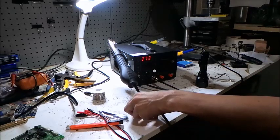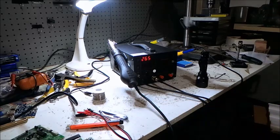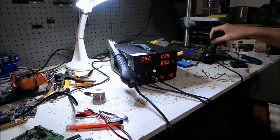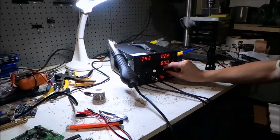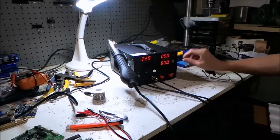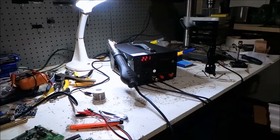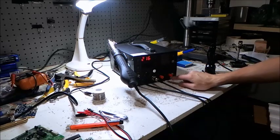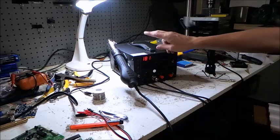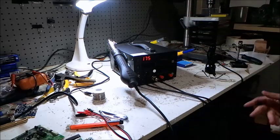So I'll experiment with it and muck around with it, and then I'm going to fix my two-thousand-dollar radio with it, because that's the main reason I bought it. It cost me $143 on eBay. It's got a built-in power supply — current limited, set to 3.9 volts at the moment — and it does work. So I'll set that to five volts, that's pretty much the voltage I usually work at for electronics. It's even got a multimeter — a voltmeter — built into it. So this is a WEP 853D, a 3-in-1 soldering station: you've got your power supply, you've got the hot air rework, and you've got the soldering iron as well. Anyway, cheers for now.